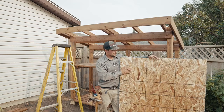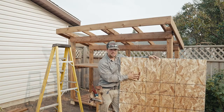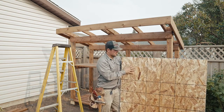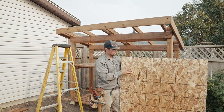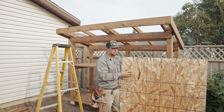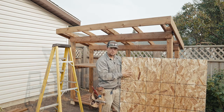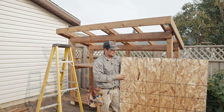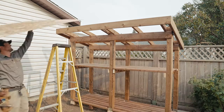So as you can see with this OSB sheathing, there is a rough side and there's a smooth side. So you're going to want the rough side up. That's on there for a good purpose. That's for when people are sheathing roofs, they have a little bit of grip, for under their soles. And it also has a bit of a grid on it and it can help in fastening the sheathing.